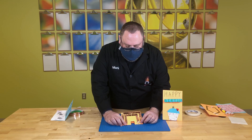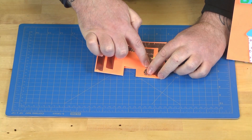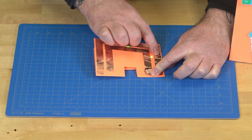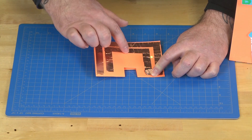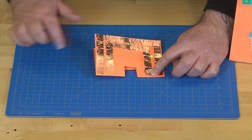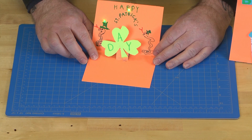Let's look at a different one now. This one is called a parallel circuit. So as you see, we have our battery here — this whole line is our positive side and we have our negative side over here. And look, there is actually a nice circuit right here because this connects and it goes right back to the battery. And then this side connects and this goes back to the battery. So this is one circuit, this is two circuits, and you can even add another one over here for a third circuit. That way you could add a lot more lights. Unfortunately your battery will run down a little bit faster on this one, but that's okay because it's pretty cool when you can have multiple lights on one battery.